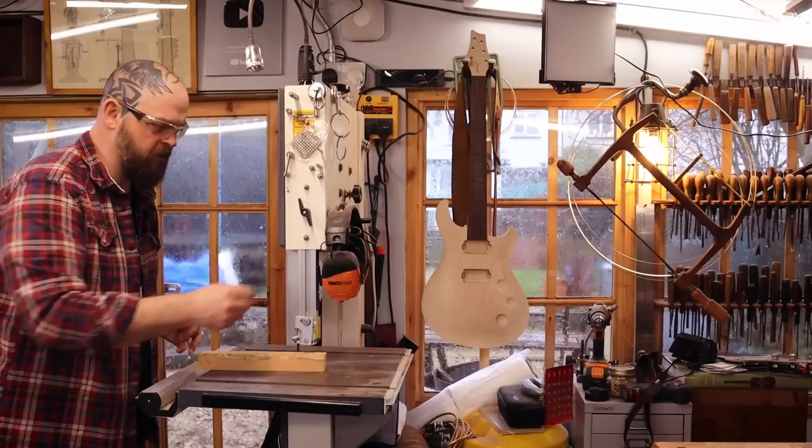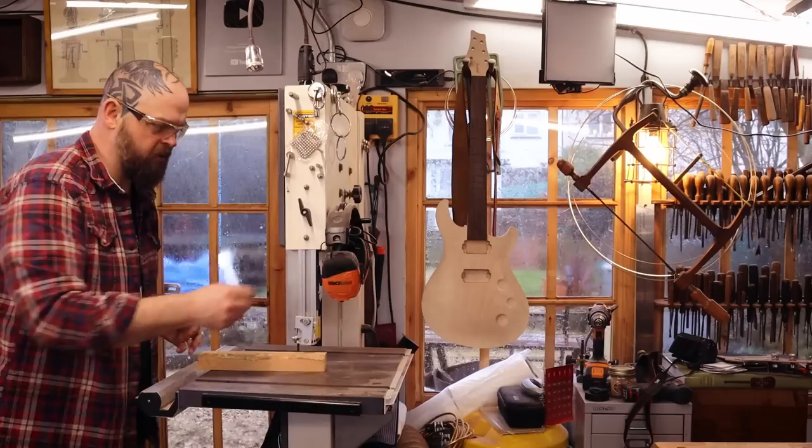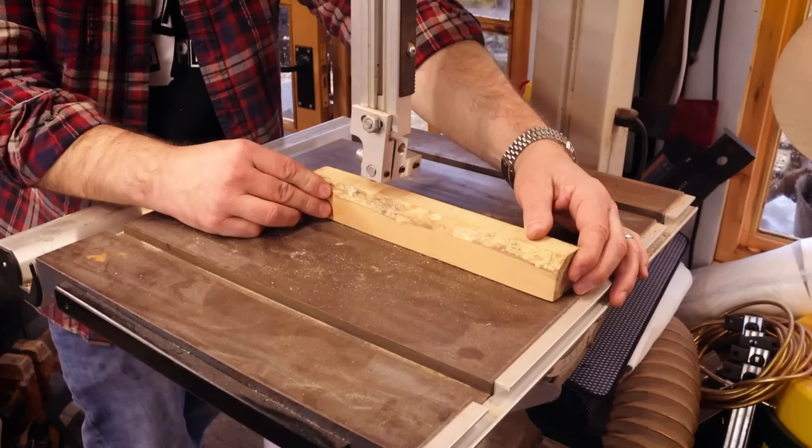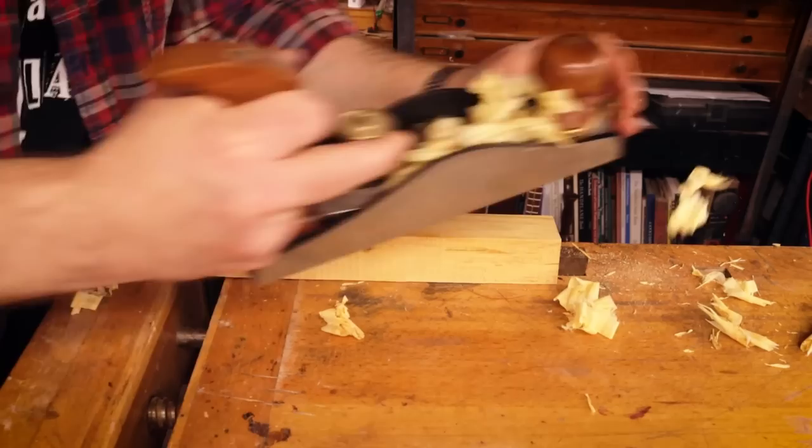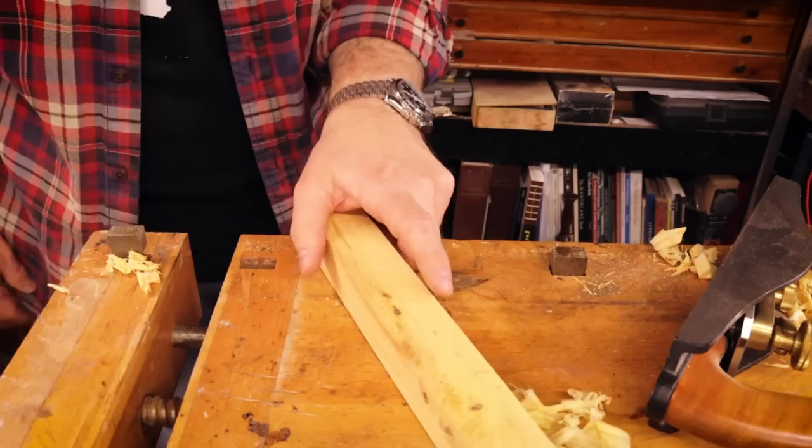I'm going to do this the easier way — I'm going to make this in three pieces. I want to cut a strip of wood down the side, plane that nice and flat, and that'll be one half — two millimeters wide — for the two outside sides. Then I want a section that is four mil or just over four millimeters wide, and that will be where the blade goes.